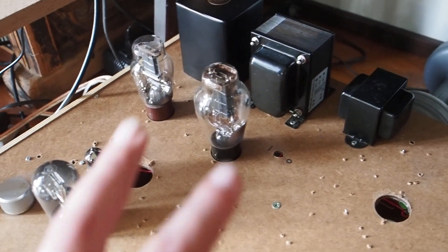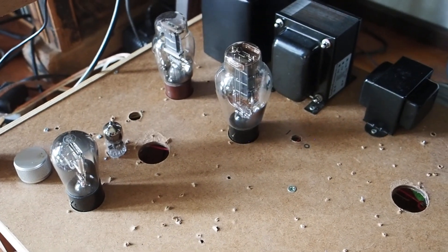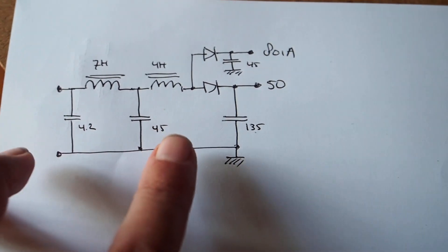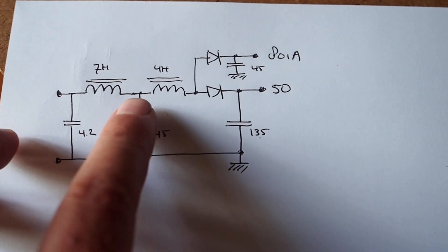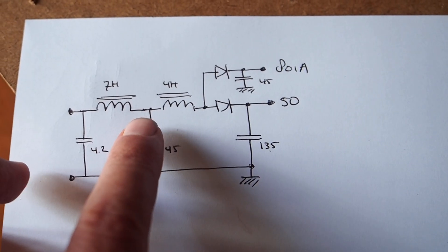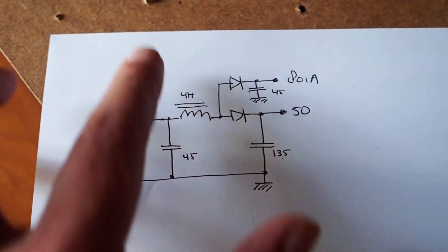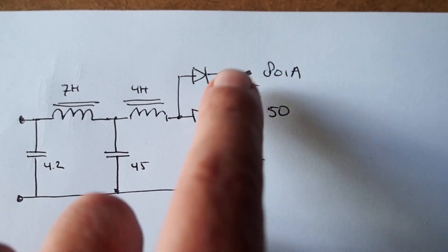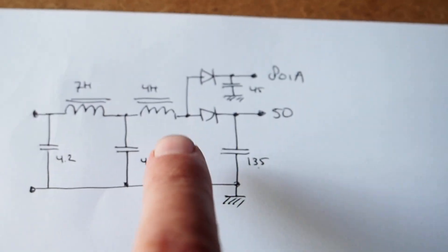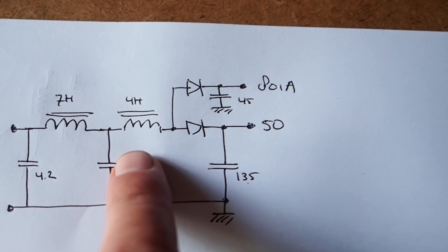So what did I do? As I said, these two were sharing a capacitor bank. The two drivers were completely isolated from the rest. So what I did is I actually implemented this - this is the power supply setup. The driver tubes also tap in here after the first choke that is shared by all, and they each have their own choke going off. At the moment these two output tubes share the same choke, but I might actually also double up on that one and separate it further.